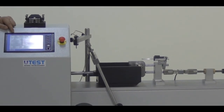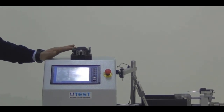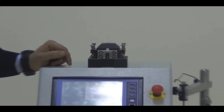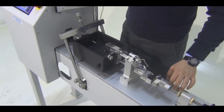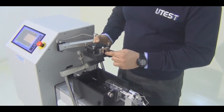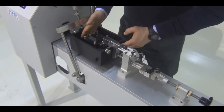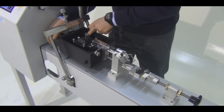Now for the last test, let's do it together. We have already prepared our specimen. We are going to test with 8 kilograms on the hanger arm, which equals 785 newtons on the specimen. Let's get started by placing the shearing box into the device. We have a slotted structure that will be locked in the test box, and then we fix the bottom part of the shearing box by tightening the screws.